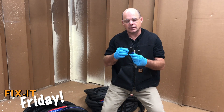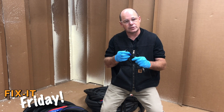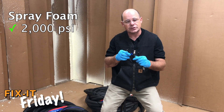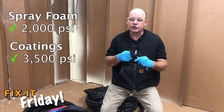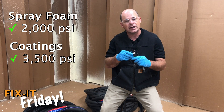The standard hydraulic hose is what they start with. There are two pressure ratings with your hoses. Typically if you're doing spray foams, you're going to have a 2,000 PSI rated hose, or what we call a standard hose. And if you're doing coatings like polyurea or urethane coatings, you might be using the higher pressure systems which are 3,500 PSI.